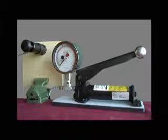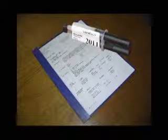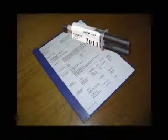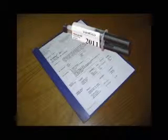Dollies to be placed on uneven, vertical, or overhead surfaces should be held in place with removable tape until fully cured. To prevent adhesive failures, it is important to allow the adhesive to cure per manufacturer's instructions. In some instances, the addition of heat may promote stronger and faster bonding. After proper cure time, the operator must decide whether or not to cut the coating around the dolly.